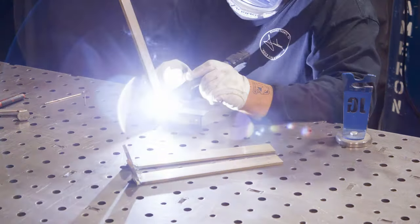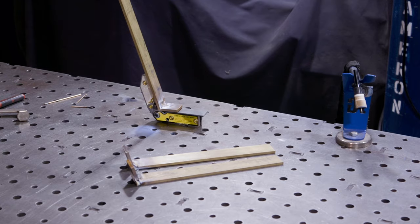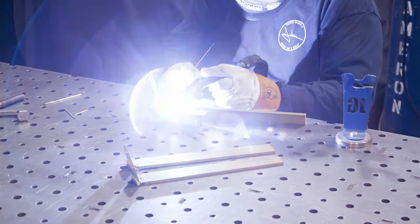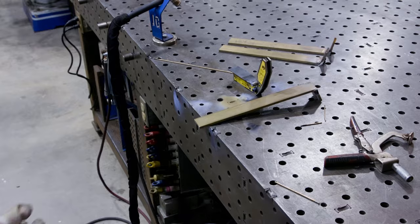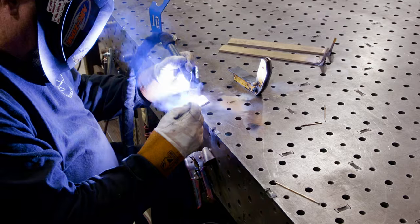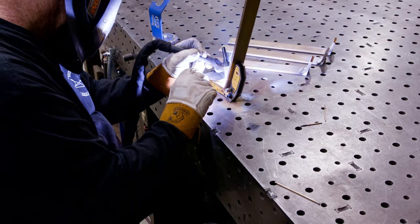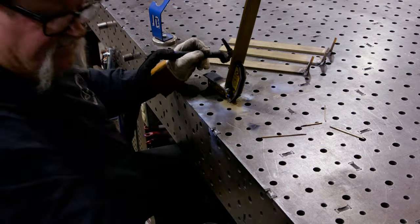One thing I learned about — I believe this is called TIG brazing. I've got very little experience welding brass. Definitely a learning experience. You can see that if you get it too hot, that brass just jumps off there and gets right on that tungsten. I must have changed the tungsten on this project ten times because of this problem — you can just see it smoking and spattering and spitting. It definitely welds better in the flat position. I had a little better success in flat position than horizontal or vertical. I definitely could not get it to weld well in vertical and horizontal position. That heat just had to be exactly right and I just couldn't find it.